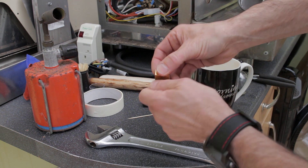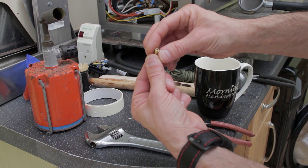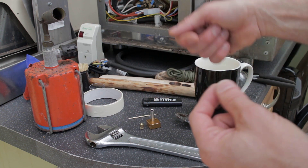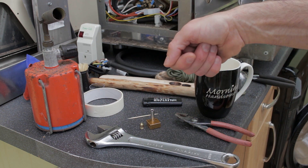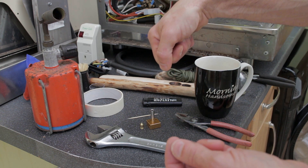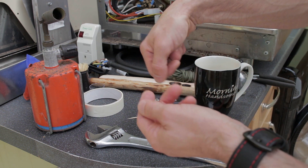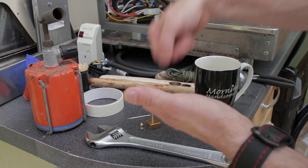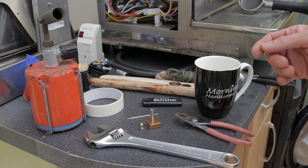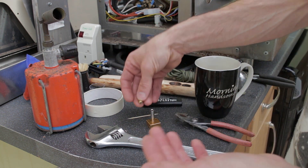So I've got some PLA stuck in this tube here and a big chunk of PLA stuck in the nozzle. A cold pull didn't work for me, and it's possible that the cold pull didn't work because of that specific problem. It seems there's a very narrow window where the filament is pliable enough to pull and stretch — which is where you want it for a cold pull — and then where it goes too solid and becomes brittle, and the filament just snaps off the lump that's stuck in the nozzle.